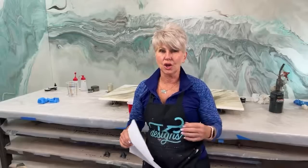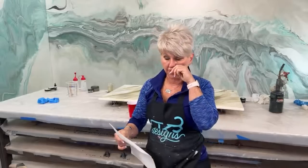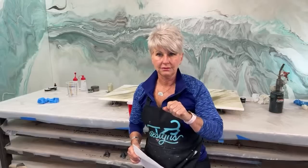If you have not watched the live that we did in Hawaii, it's on the Stone Coat Countertop YouTube channel. Go watch that live - it's two hours, a bonafide live, and there's a lot of great Q&A. Temperature and humidity makes a difference. Also, do not use a mixing paddle when you're mixing your UTC. UTC - the Ultimate Top Coat - comes in two sheens: matte and gloss. It is a modified polyurethane roll-on material - it is not epoxy. You apply it a minimum of 24 hours after your flood coat.